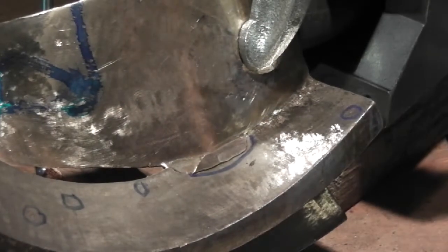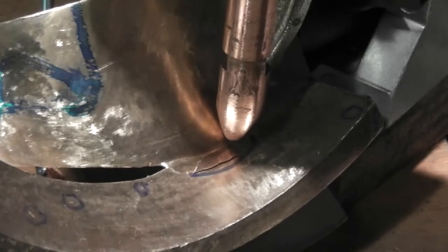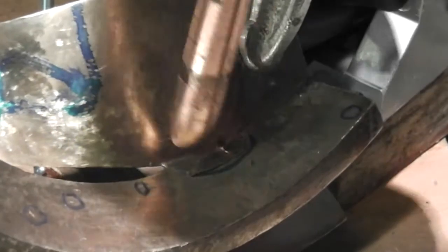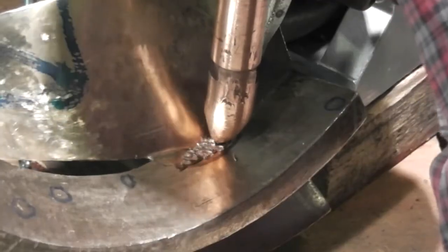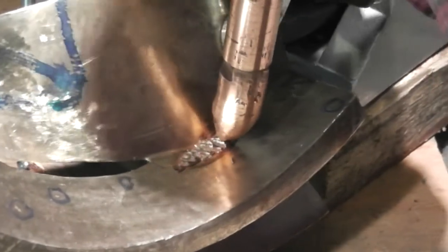This shows how a piece of filler rod, pounded flat and trimmed to size, is used to fill weld a slight depression on the work base. The welding begins at the center of the filler material and moves towards the edges. The location of this weld requires using a special corner welding tip. Note that this weld was done prior to learning that using liquid flux for the welds is a must.